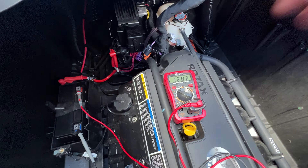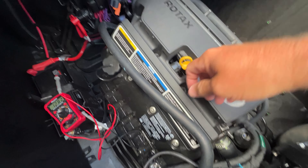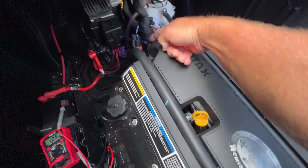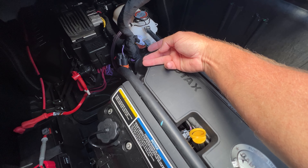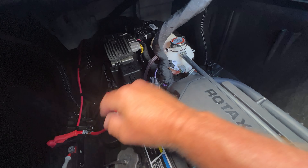If you run the boat and you're under 13 volts, if it doesn't move, you'll want to remove the engine cover. With the torx bolt and three nuts, this plastic cover pops off. These hoses just fold out of the way and you can get to it. Underneath you'll see the wiring harness — there's another harness that has three yellow wires. Those three yellow wires come from the stator to the rectifier, and that decides when it's going to charge and how much output, and pushes it to the battery.